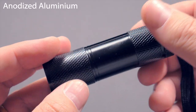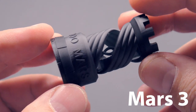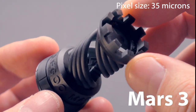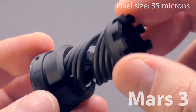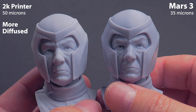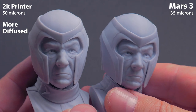A smooth surface is consistent in how it reflects light, and indeed, with much smaller pixels, this Rook printed at 35 microns has much less Minecraft effect. Reflections look right all around. At 50 microns, gray resins look a bit like frosted glass or fine sandblasted. The light is diffused, reflections are scattered. It is quite nice, but it also softens your perception of details.